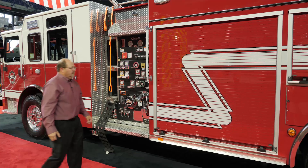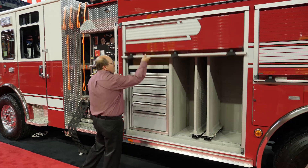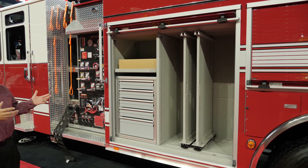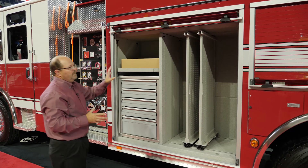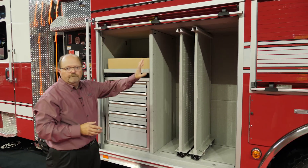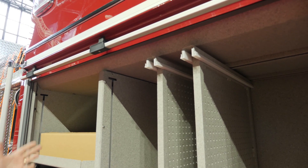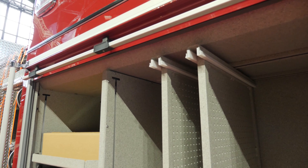Moving to the body, we're featuring our third-generation heavy-duty rescue pumper. It is made from aluminum but also available in stainless steel and in multiple different sizes to meet your needs. Inside the compartments, you will find clean compartment interiors with all the wires hidden behind false removable panels. The rolled doors are covered with pans to protect from equipment inside the compartment and from road splash rolling up on the pan when the door rolls up.